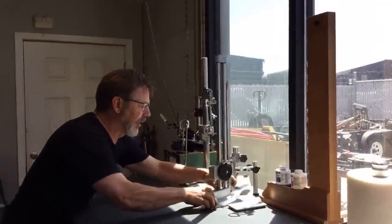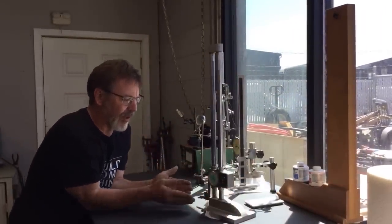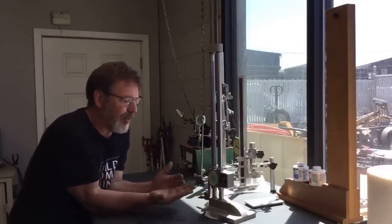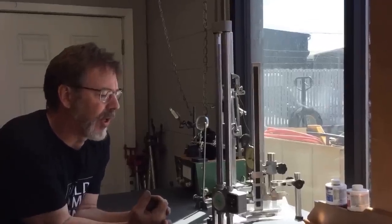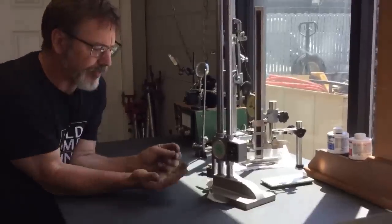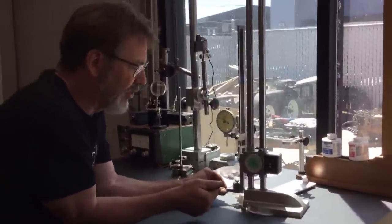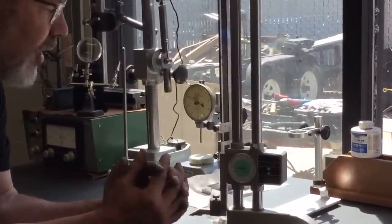Billy Huddleston's asking if you can talk about your height gauges on top of the Metrology Center. Okay, so let's take a look at these. The height gauges are a really interesting thing. This one here is not an expensive one, it's a cheap one, and I'm looking for a Mitutoyo. I'm really having some problems with this one. When I start using it, I'm getting some inaccuracies because it's just not rigid enough. So there's a reason these are only $100.